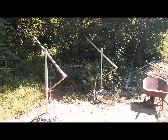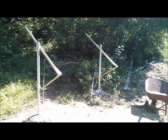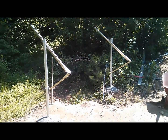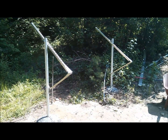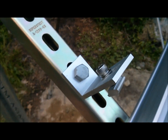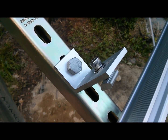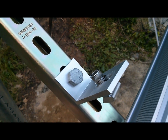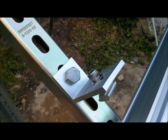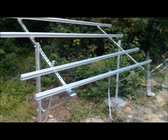These are the two posts set up in summertime mode so the panels face towards the sky a bit more than in winter. We put three holes on the post for more adjustability since I wasn't sure exactly how it would all come together — I'm actually using the lower holes for the bottom supports. The next step is to put L brackets onto the Super Strut; these L brackets are from Renogy, available at renogy-store.com, though you could probably use Super Strut for your cross members. These hook on to extruded aluminum rails.